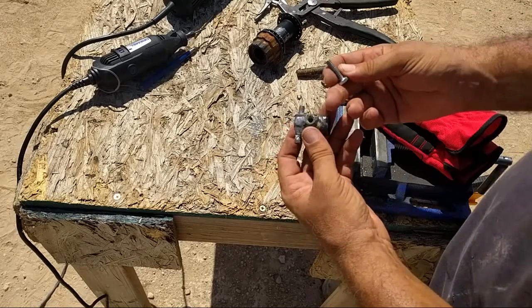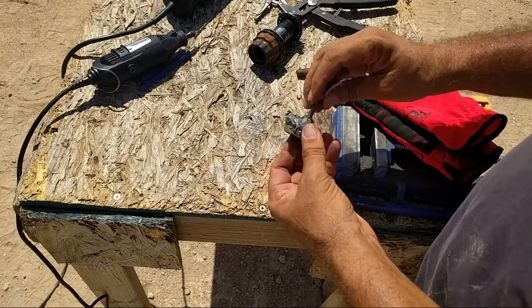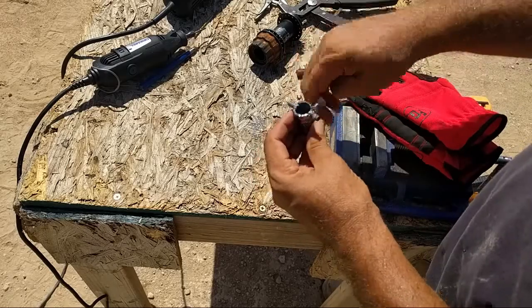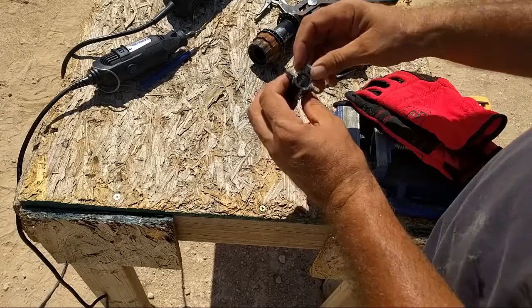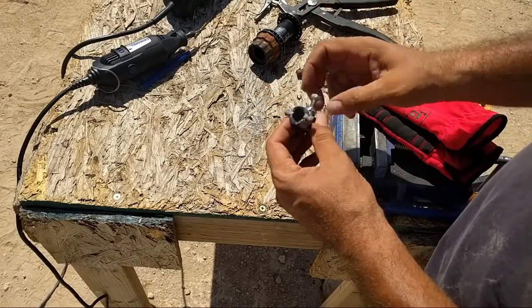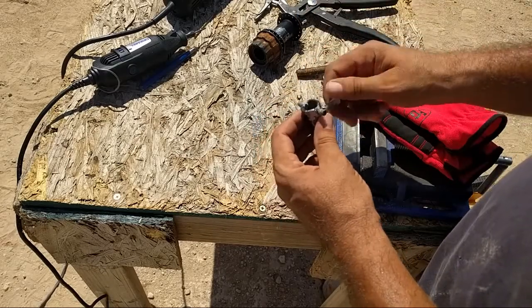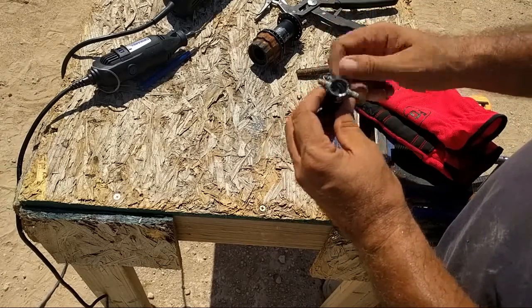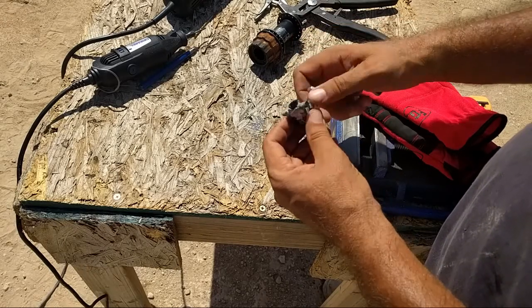So it probably isn't good for things, but usually what I'll do is I'll take one bolt, put it in there just to keep splatter from getting inside. That also helps you align it with the hole, because now you've got the bolt coming through. That'll keep it centered on the hole where you want it. Do your welding, crank it out, get it out as fast as you can, if possible, because when it cools, it's going to really shrink down on it. Then if it's stiff, go in there with the tap and just cut through it again. And it seems fine now. You can do it all the way down by hand. So that's good.